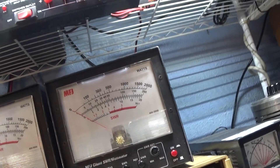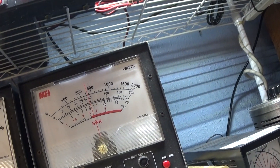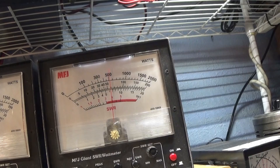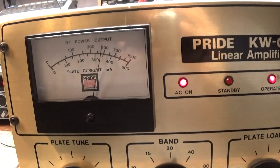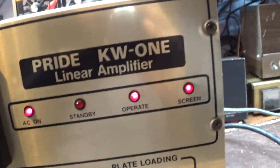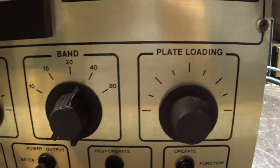Turning up the dead key a little bit using the band switch bias control. The power output meter is going backwards now but we've got the dead key dialed up. Audio talking is standing still, about 550 watts average, and still about 700 watts peak. I think this thing would do that all day long with that 4CX400 tube in there — it doesn't get hot the way the 250B does; the 250B overheats at this kind of power. Dead key is 600 watts, swinging about 700, which would be pushing a 250B, but with the 400 in there it'll do it all day long.